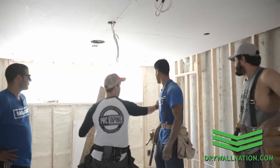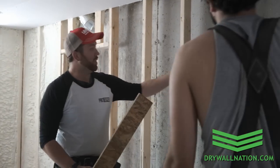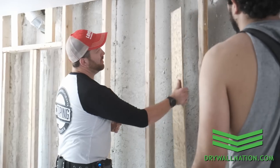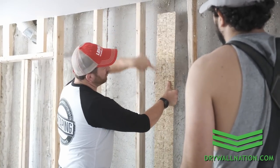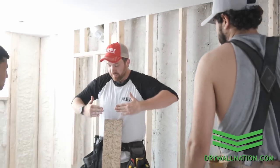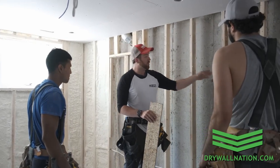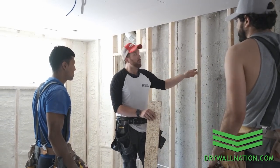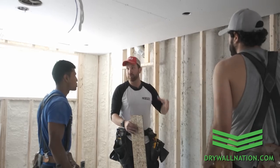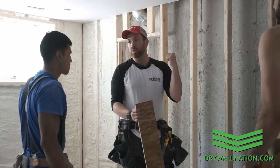So for example, behind us here, a full 12-foot sheet, normally you'd have to cut it short on a stud. When you're using Buttboard, you let it float, and then you piece your Buttboard behind, you screw the front, and then when your next piece comes on, it recesses your butt joint. So you save on drywall waste, because you don't have to cut your sheet short to land on a stud. You also don't have to stagger your butt joints. You still can if you prefer to stagger them, but because you have a floating joint now, it's structurally superior.